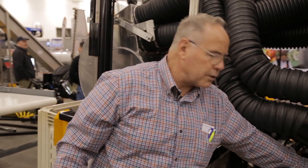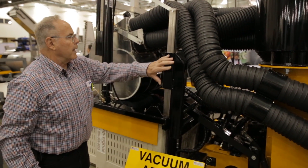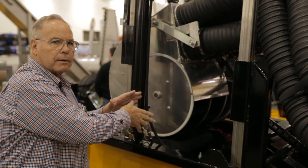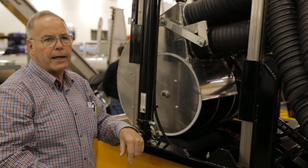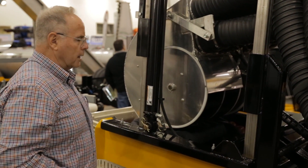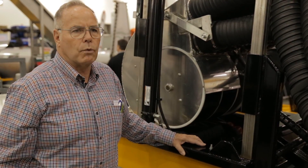We've got a large centrifugal blower here, and we control the speed of that to keep our vacuum where we want it — all variable speed. The apples are brought into a pocketed wheel so each apple goes in its own pocket, then slowed down and laid onto a foam pad which rotates and fills the bin. There's an electric eye that as the bin fills it automatically bumps up, and when the bin gets full, it ejects the bin, goes up and picks another bin off the trailer. It takes about one minute to change the bin.